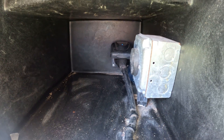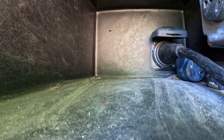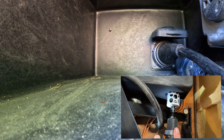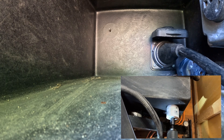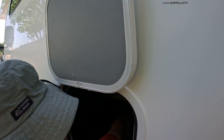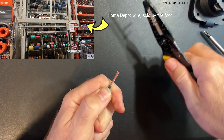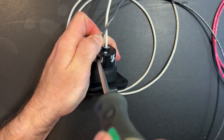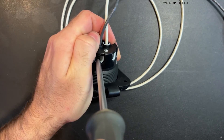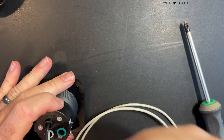It's not perfect but it is definitely less gross than it was before. I think we're ready to go ahead and get that hole drilled. We've got a little double camera action for you now so you can see where we decided to put the hole in the black box under the dinette. We're doing a little basic dry fitting here. We want about half an inch of exposed copper on each wire — we're going to go white to white, black to black, screw it in nice and tight. You want it snug; you don't want it to slip out while you bounce down the road.